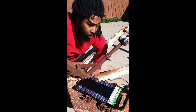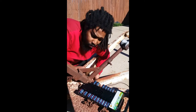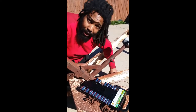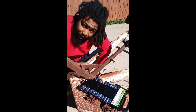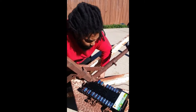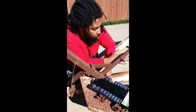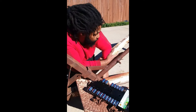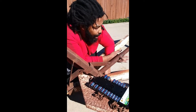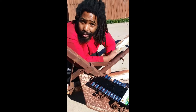Buying a boat trailer is the better way to go, in my opinion, if you're going to go with an old used trailer. Boat trailers are built with better-grade steel that can handle marine applications — constantly being in and out of water that is meant to rust and eat through things. We've inspected all the welds; I used to do welding in high school and on some fabrication jobs. They're all still solid — they can support my weight, which is a good test. You can also take a 2–5 pound hammer and hit your joints with some force, and if they don't crack, they won't bend under the weight of whatever you're building on top.